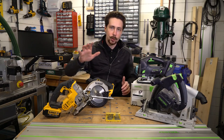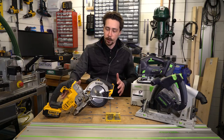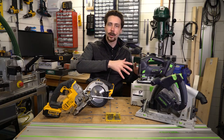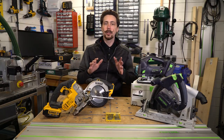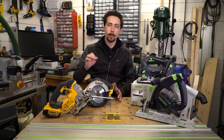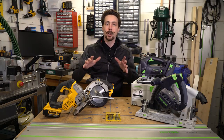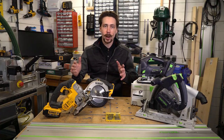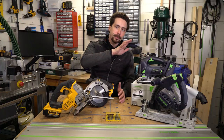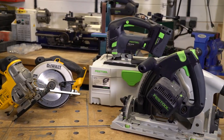You have to be careful about the ecosystem when buying cordless tools — you're basically buying into a system. My old DeWalt system has batteries that swap between all the different products, but I can't use those batteries on my Festool products, so you end up stuck in one ecosystem. It's best to look at what you're likely to use and buy the system that works best with your most-used tools. Makita has a really wide range and is quite a good option; at the very top end you've got brands like Hilti and Mafell — very much tradesman tools.